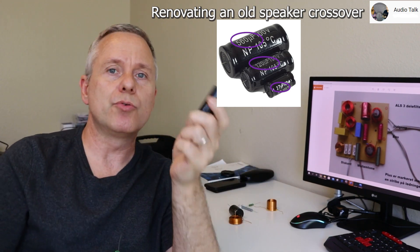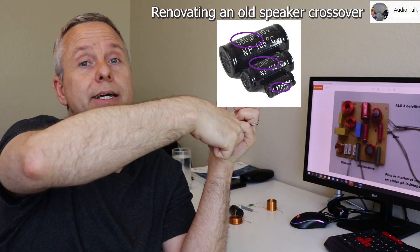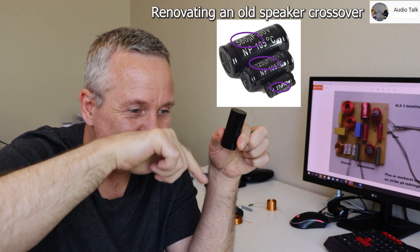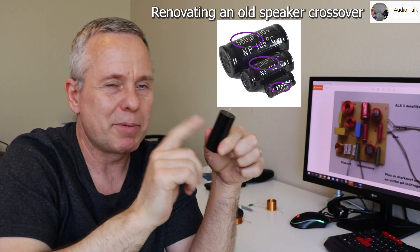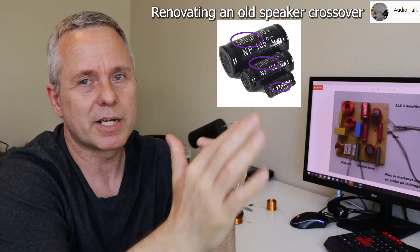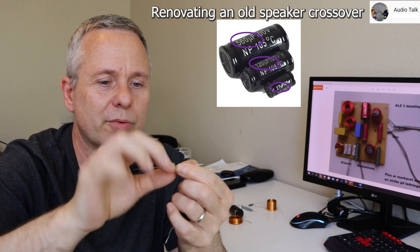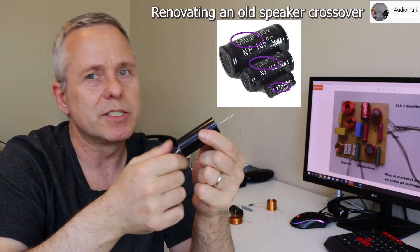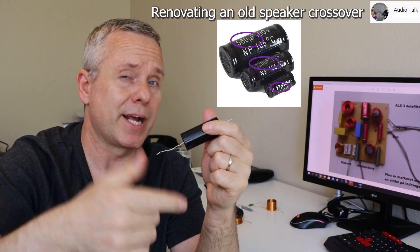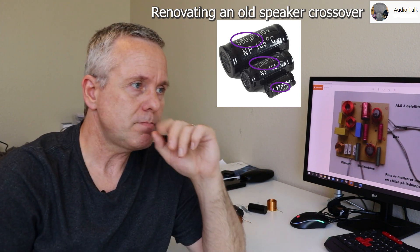If you can identify the tweeter circuit — your high-pass — grab the wire from the tweeter and follow it all the way into the crossover. You can see the little circuit line going from the tweeter wire into a capacitor. If that's an electrolytic capacitor, change it to a film capacitor. See how the film cap is all smooth, while the electrolytic has these ridges, little rings and notches all the way around. Change it to a polypropylene capacitor — the MKP type.